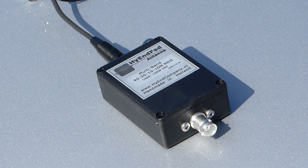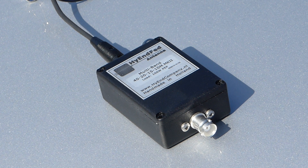Frequency range on the bands is very impressive. Without the need of a tuner, the 1.5-to-1 SWR bandwidth of the Ultralight Mark II Packet is 150 kilohertz on 40 meters, 350 kilohertz on 20 meters, 450 kilohertz on 15 meters, and 1.5 megahertz on 10 meters. That means full band coverage for both CW and SSB on both 20 meters and 15 meters.